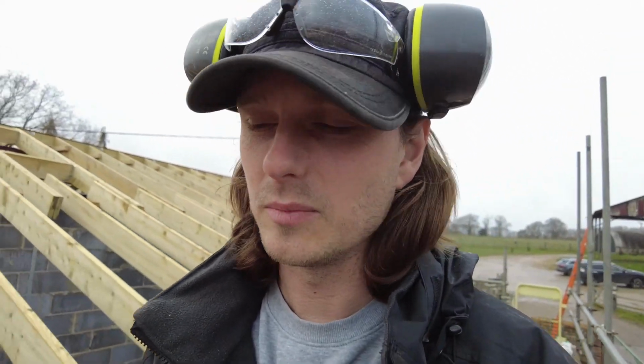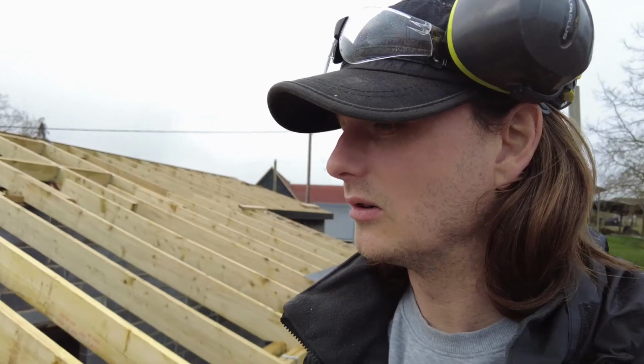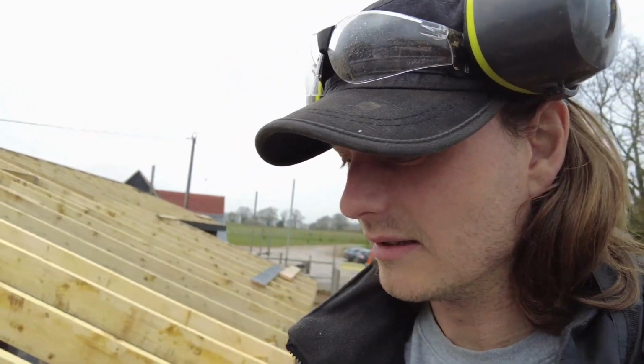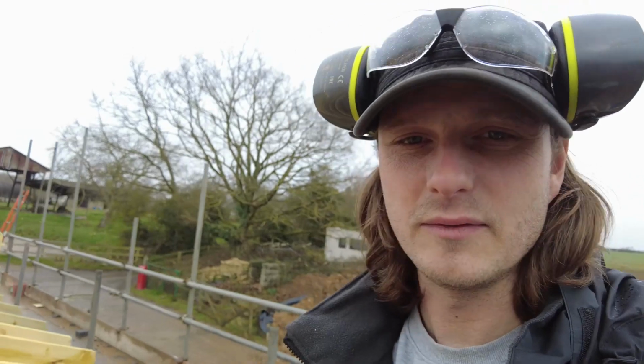I said to him the other day, what's your tolerance on this then? And he was just like, well, I tried to get it as flat as possible because I knew what sheets you was getting on the roof. I don't think he really done that, they done it so quick. But I'll give him a little bit of tolerance. Maybe 3 or 4 mil. I've already been round, but there's some that are over that.